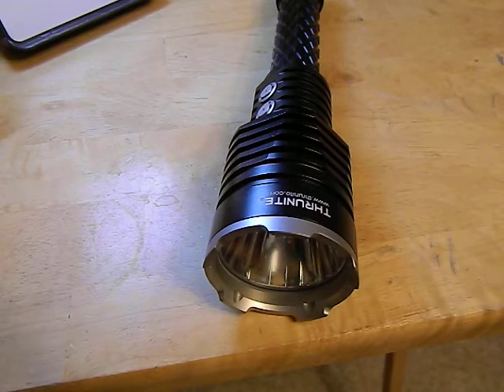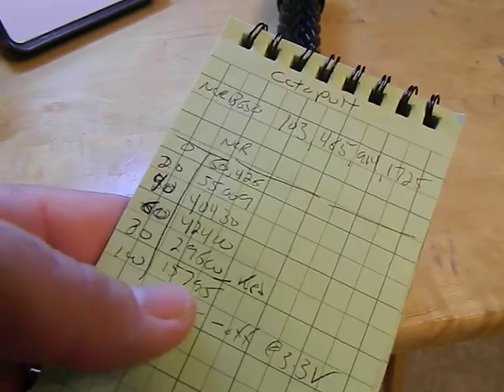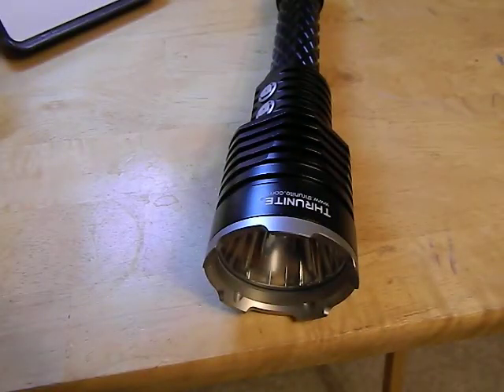It's a lot of light for the money. You might say it's a hundred dollar light, but if I was still doing search and rescue work this is a light I would look for. Really good run time — I tested this thing and I got way more than what Thrunite says: I actually got 105 minutes. At 60 minutes it holds two-thirds of its light, at 80 minutes it holds 50%, and even at 100 minutes it still has 25% — you're still talking three or four hundred lumens after 100 minutes. At 105 minutes the light did have a hard shut-off and I checked the battery at 3.3 volts.